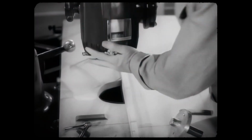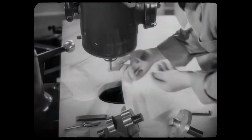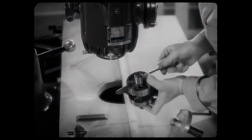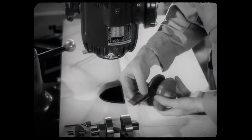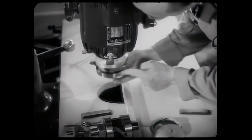Moreover, the arbor is removable, and shaper arbors of various lengths and sizes can be substituted to accommodate your present solid cutters with various sized arbor holes. The DeWalt can be used with serrated inserted knives in positive locked safety heads, or with a slotted arbor permitting the use of standard bevel-edged knives from your shaper cutter rack, or for irregular shaping with a roller collar.